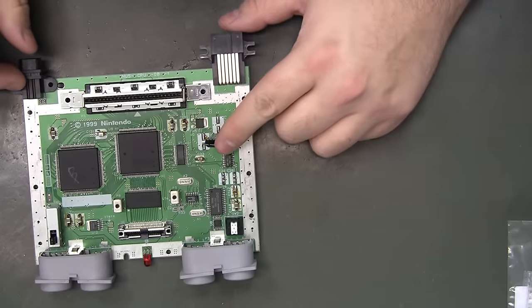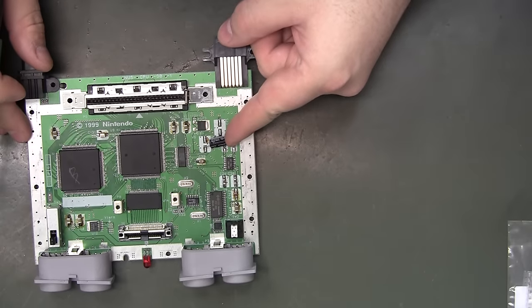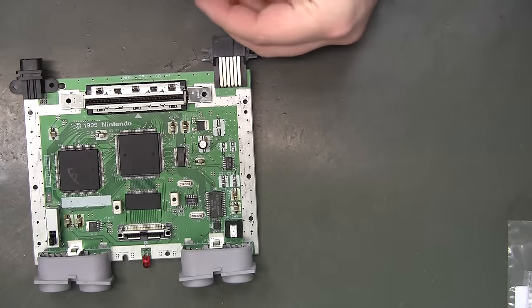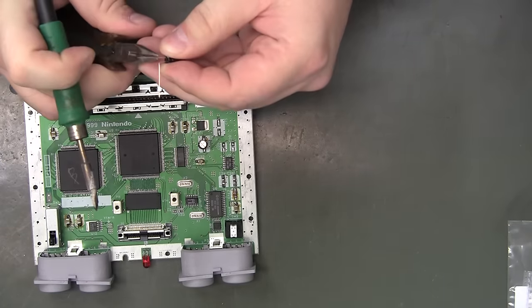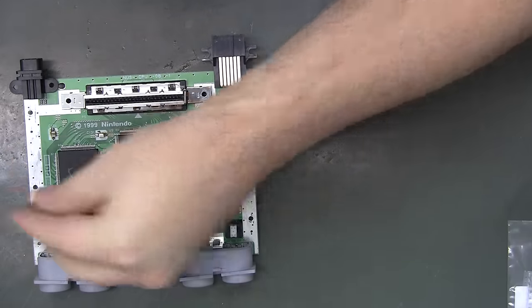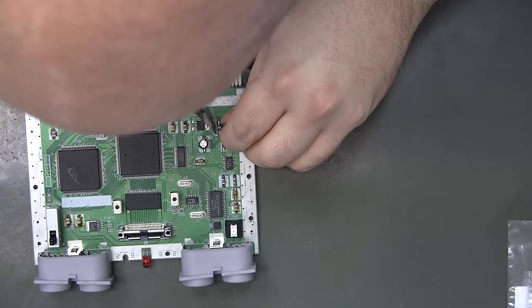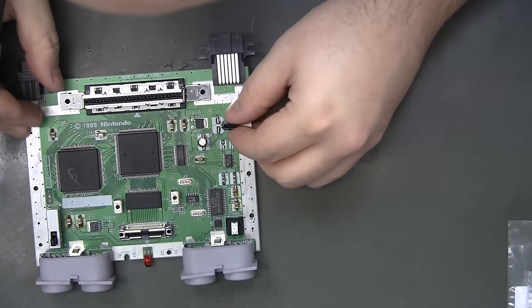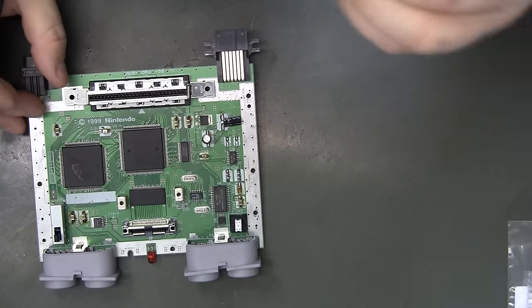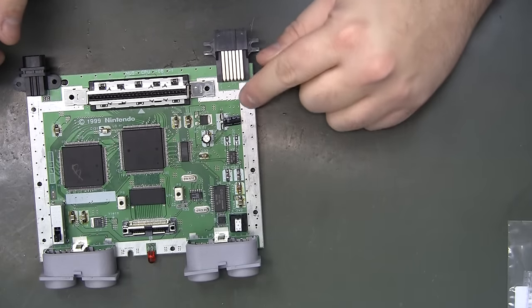The great thing about having those legs on there is you can actually twist your caps around and lay them. Just as long as those legs don't end up touching each other, you're fine. I'm going to leave that one up as it's covering the pad on that one. So you don't want to make that bend too close to the cap. Keep inside of that tinned area. Keep it inside the green square, because your heat sink sits on top of here, and that's where it touches down.